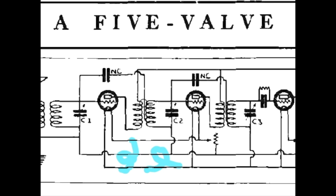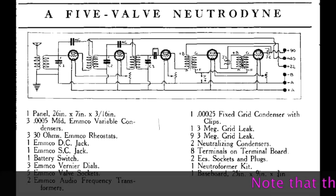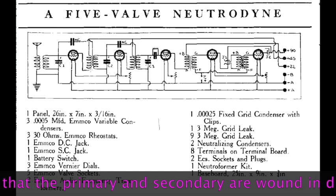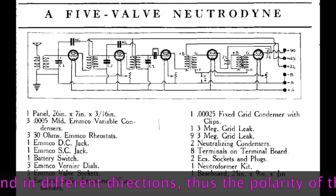The GE-514 has its coils wound in the same direction. So in terms of passing a signal from here to here, it really doesn't matter, particularly with AM, because the audio information is impressed on both the positive and negative sides of the RF signal. So as the primary at one end or the other would be going up, this tapped point at the secondary would be going down.